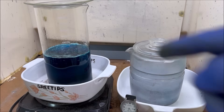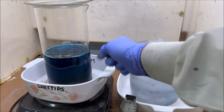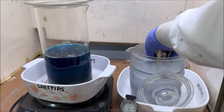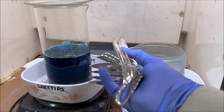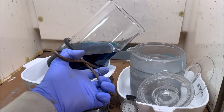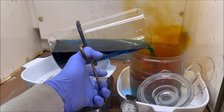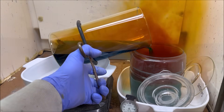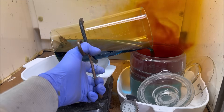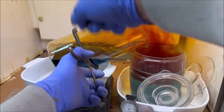I came out at four o'clock in the morning to check on the reaction. The solution is boiling and there are no fumes, which tells me the nitric acid has ceased reacting with the silver in the inquarted gold. I'm going to add some sterling silver pieces to one of my silver jars, then pour this liquid off into the silver jar. That blue liquid is the secret sauce — it contains lots of silver. All the silver added during inquartation, plus any silver and base metals already in the gold, is being extracted by the dilute nitric acid.